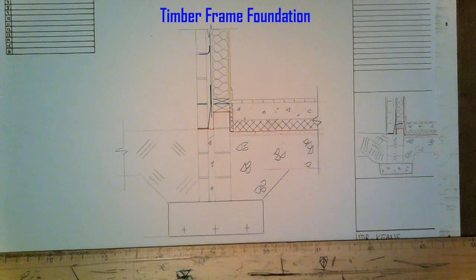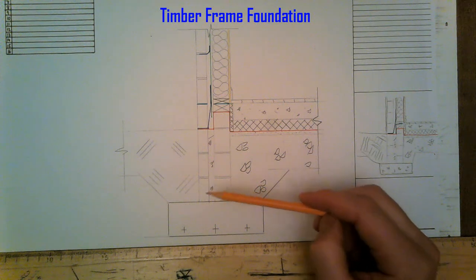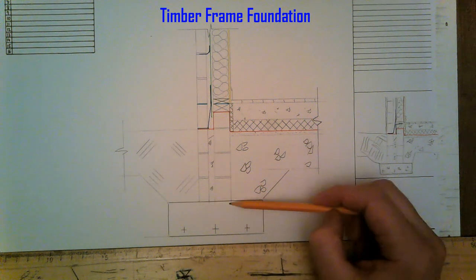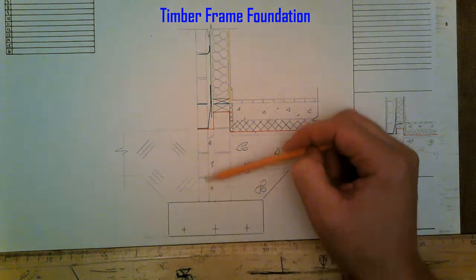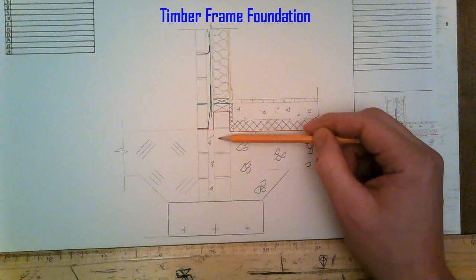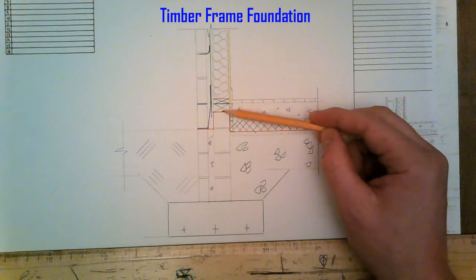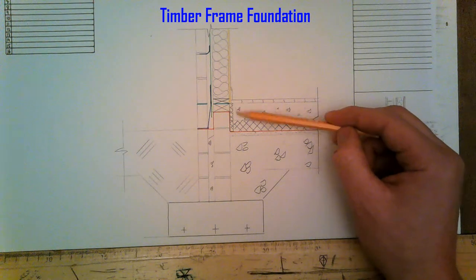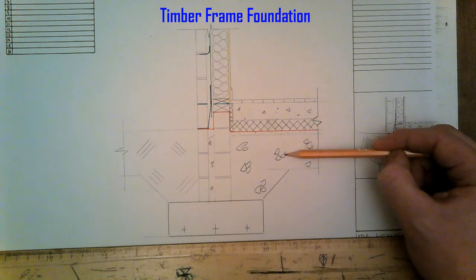The timber frame foundation detail is finished. The foundation itself is 300mm high by 900mm wide. The difference with this wall is it's 300mm total compared to a traditional block wall at 350mm. You have 100mm outer leaf, 50mm cavity, and 150mm block. The outer leaf is 100mm blockwork all the way up; the inner leaf comes up three full blocks, then DPC across, working back down with the 75mm sole plate, radon barrier across, subfloor 150mm, 100mm insulation, then radon barrier across, 40mm binding, and 150mm + 150mm = 300mm hardcore.